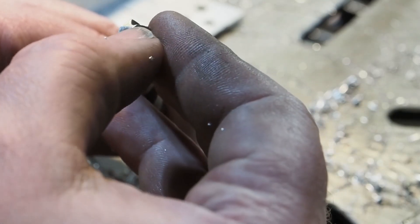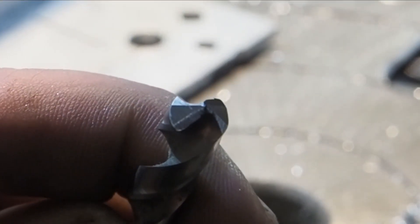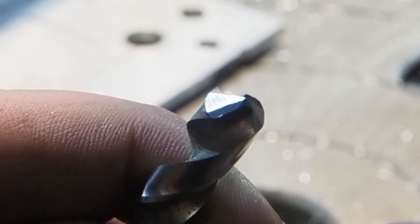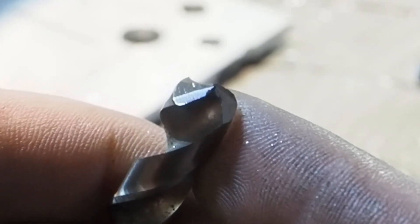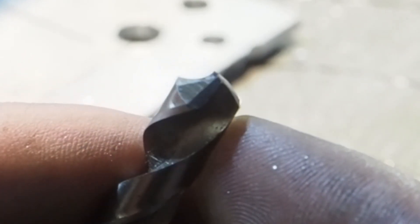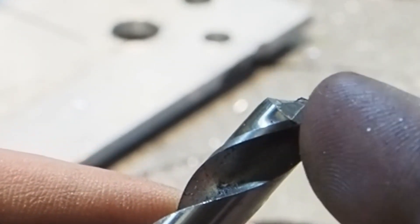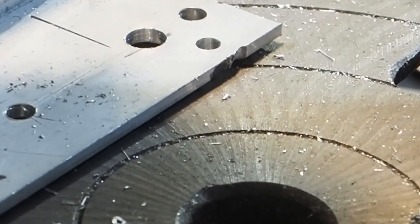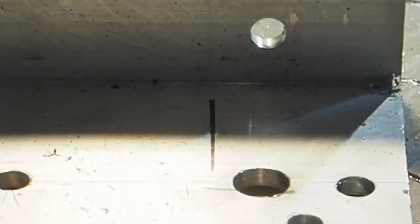Here's my next effort. You can see a little bit of black on the top facet - I still don't think I quite have it right, but I am new to this. I did a whole bunch of experimentation, that's why there's like six facets on here. But I did the primary and then I did the secondary. Chuck it up, let's see what we make. Do we get chip welding or do we get an ovular hole?